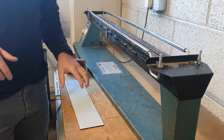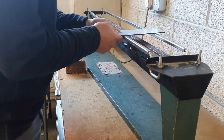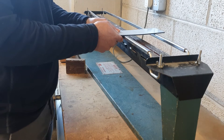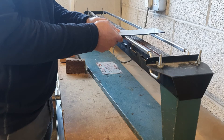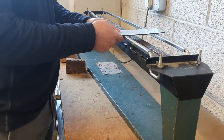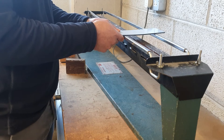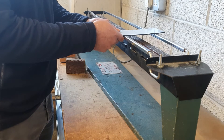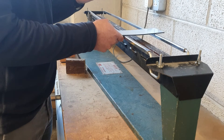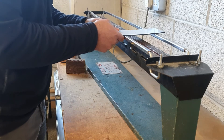I'm going to do a 90 degree bend first. We must place our line that we want to bend directly above the heating element. We then hold it for approximately 30 to 45 seconds. You can tell by feeling it whether it is ready. It's very important that you wait until it is ready to bend, because acrylic is quite brittle and if you try to bend it when it's not ready it will just snap. Likewise, if you overheat it, it will start to burn the plastic and you end up with a poor finish, so you want to give it just the right amount of time.